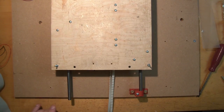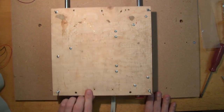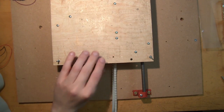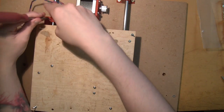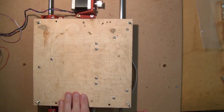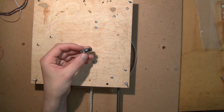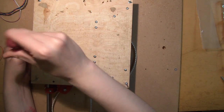Once the carriage is in all four bar clamps, we're going to fasten all those bar clamps. First, move the white carriage far enough back that you can just reach it and screw it in so it doesn't move around anymore. Then move it even farther to screw the next one in, and do the same on the other side. That should make it really straight. Last thing is to make sure the linear bearing holders are screwed in all the way. It's helpful to use one of those tools to hold the nylock nut from the bottom so you can screw them in pretty easily.